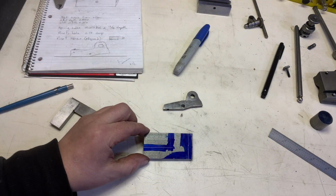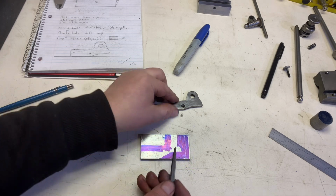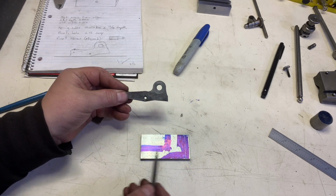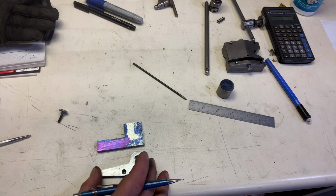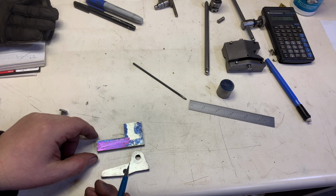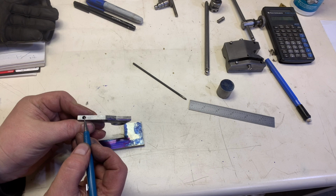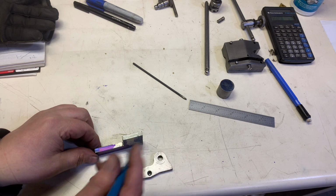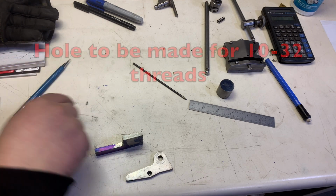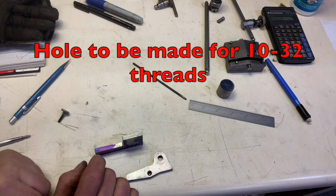All right, so I found myself a piece of steel that's 1/4 of an inch thick. So basically, this is an L shape. Let's get that done. Okay, so I've got my L-shaped thingy cut up. So I looked at the starred one, and this here, the on center, is 5/16 of an inch from the end. So I'm going to measure 5/16, and I'm going to make a mark here with my punch, and then I'm going to drill a hole.